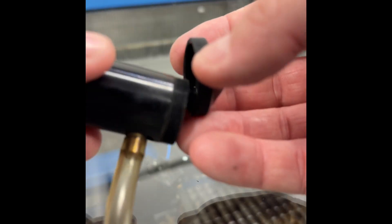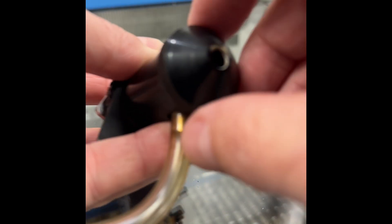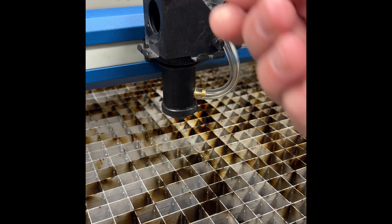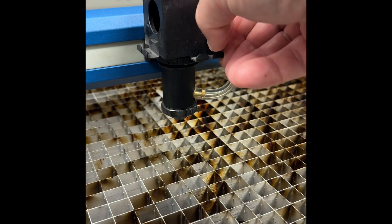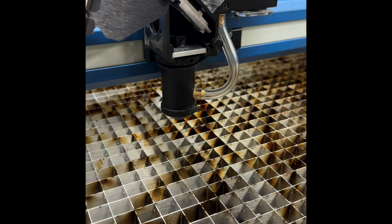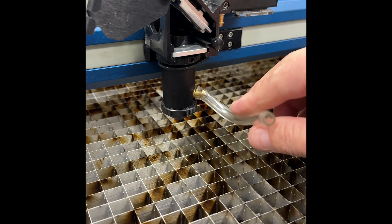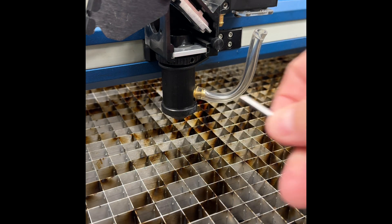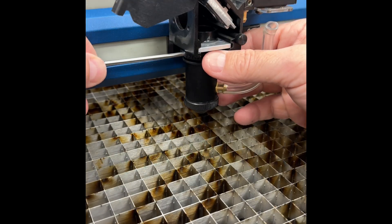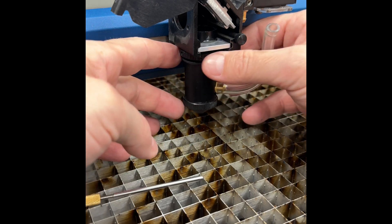This is the old style that does not have the insert in it. Let me pull that off and show you what that looks like. This is the air assist tube. Now I'll pull off the new style lens assembly. Just the way we do on all the standard Makers and Edges — open up the window, pull the air assist tube down, and then use the manual focus gauge and put that in the ring.